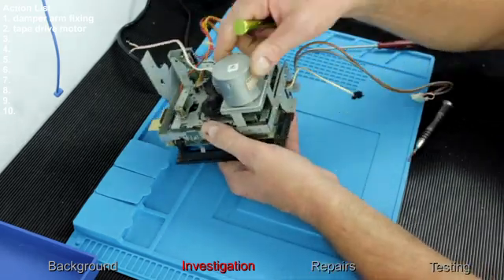This connection is the ground, the zero volt. Getting the wires the right way around is important because the motor won't run in the right direction otherwise. The damper arm is now attached and fixed in position. Powering up for the first time — the motor's running. Fast forward works and the counter is working.